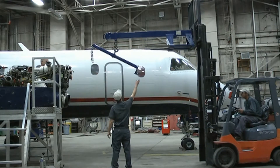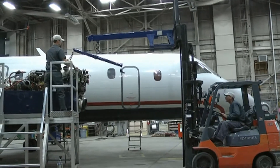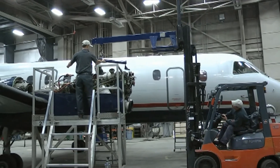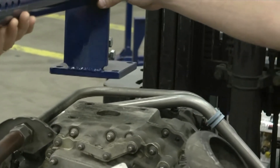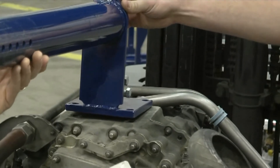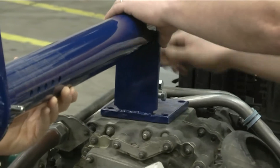Raise the engine hoist adapter with the lifting device until the adapter will clear the power unit PGB assembly, then maneuver the adapter over the power unit PGB assembly until it is centered both longitudinally and laterally. Lower the adapter until the PGB forward attach plate rests on the upper PGB mount section and align the holes in the plate with the holes on the upper PGB mount. This operation will require application of slight downward pressure to the rear of the adapter to aid in keeping the adapter horizontal until the adapter is attached to the power unit PGB assembly.